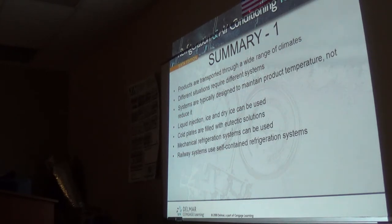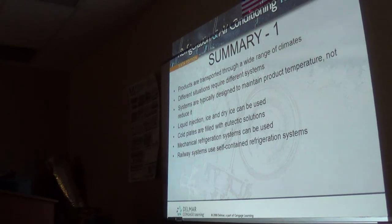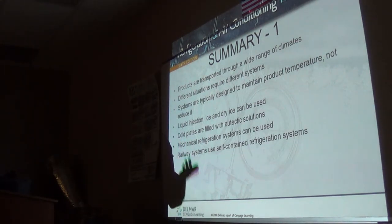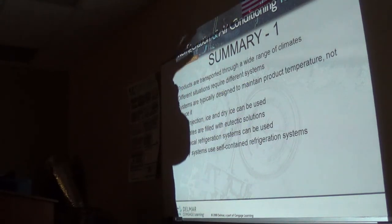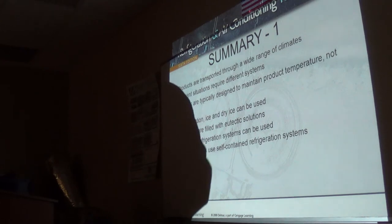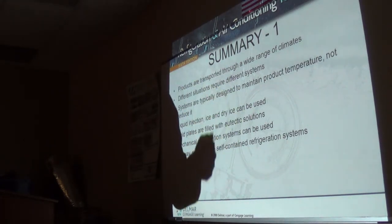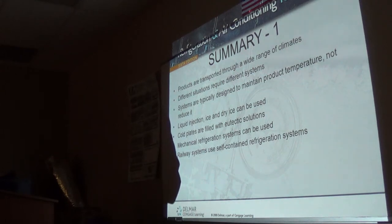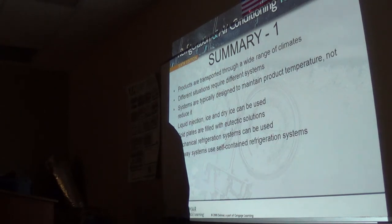It's pretty tough to have those things explode. Conditions have to be right. For example, if I have a gas leak in this room and the gas concentration is below 5%, it's not going to explode. If it's above 15%, it's not going to explode. But if it's between 5 and 15%, don't light your cigarette. That's the range within which a catastrophic explosion is possible. Because of the oxygen? Well, that percentage mix gives you the perfect ratio, because when you do burners, you find 20% oxygen is what we need. So just be careful.